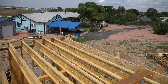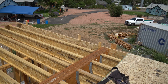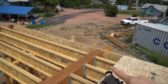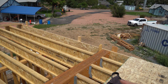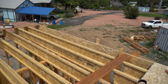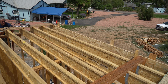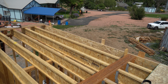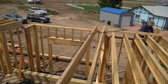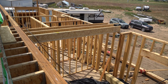Right here you can see the top of our big 24-inch beam. We haven't put the sheathing on in this section even though the joists are all in, because the next four-by-eight sheet of plywood OSB floor sheathing is going to go over that beam - on these joists here. So we have to get those joists nailed in before we can add the sheathing on that portion. As you can see, that's looking down into our living room area.